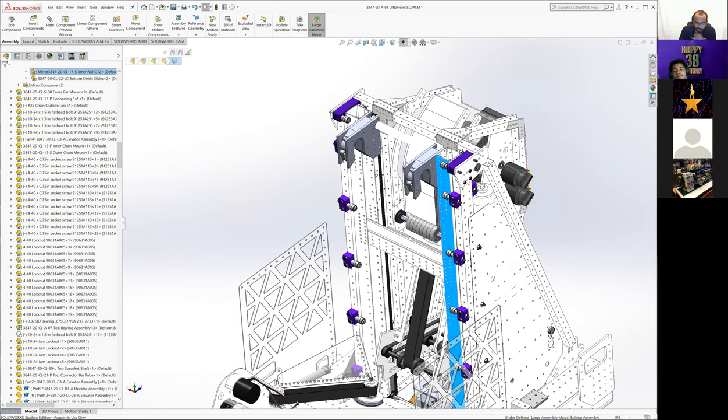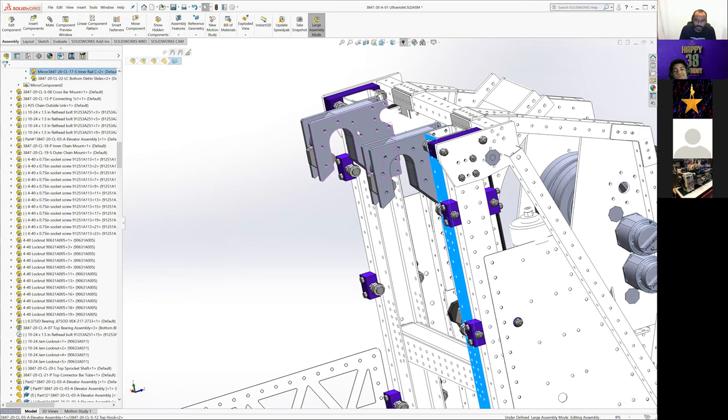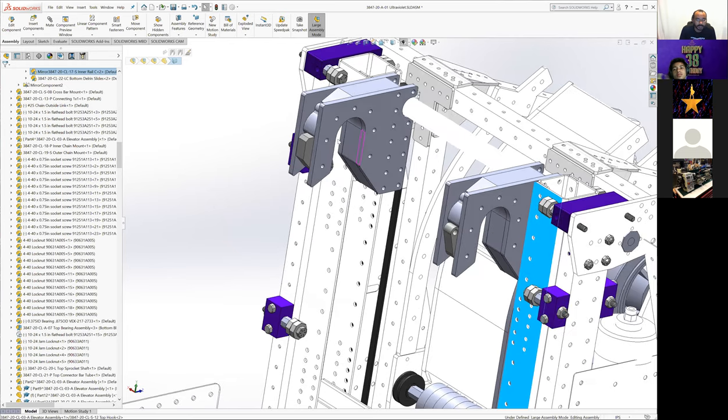Once we knew we weren't doing the buddy climb, we changed off of having these gate latch type things that would have latched us to the bar down here and let some play. They were kind of like these funnels that when we drove in, they would have latched us, made out of polycarb that were mounted down here, to having some higher latches that were easier to hook on. We had a lot more height that we could reach, so we could reach really tall once the hooks were up here. We still got more than enough off the ground.